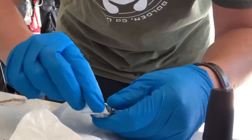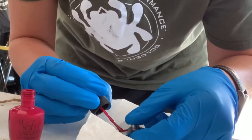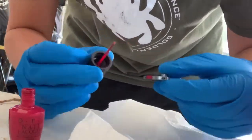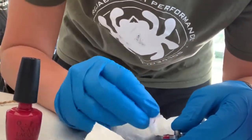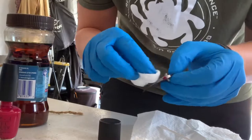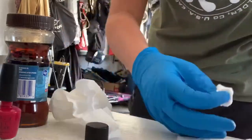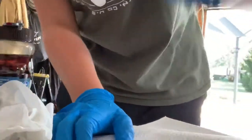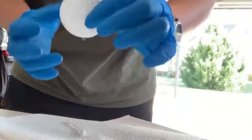Right now I'm cleaning off this blade, and this is a very important step because if there are any dirty spots or defects it will show up in the end. I'm putting nail polish on basically anywhere where metal touches metal — the stop pin, the tang, where the two bearings go, the detent track, and more depending on the locking mechanism of your knife. I'd suggest doing two different sides separately because it gets hard trying to balance both sides drying and staying clean.